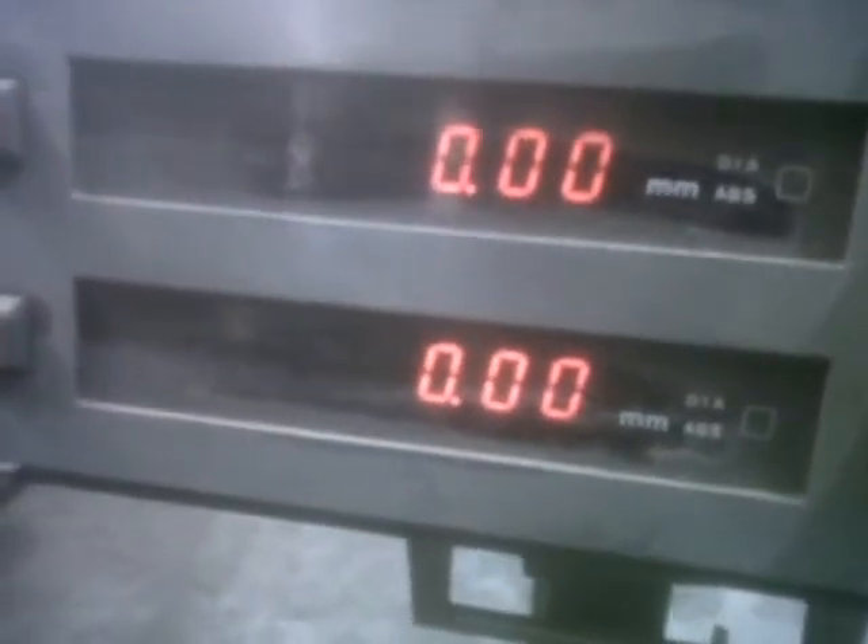We're just using the digital readout, running that back on the Z-axis so we know where the repeat goes to — where to stop it every time we run it back through. I think we're all set up and ready to run. Direction is showing on here — the table is now moving away from the head, which is the direction we wanted. Let's fire.